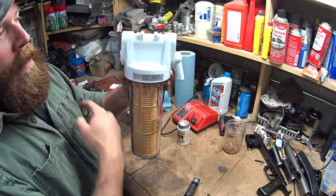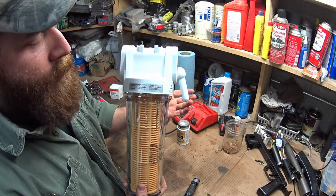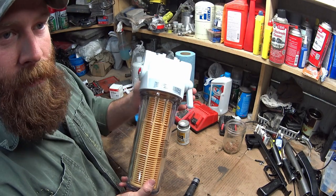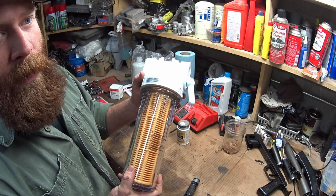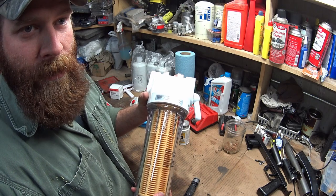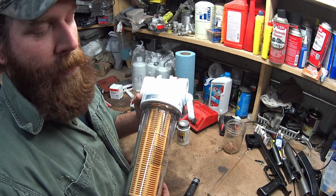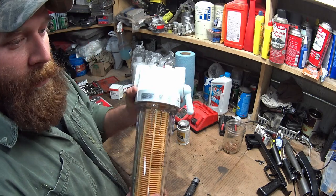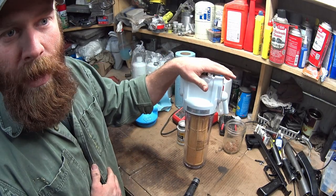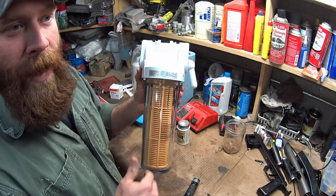Clean water goes back out the top. You can also put a pressure gauge on here to see how much your water pressure is dropping. If your water pressure drops a little bit, clean out your sediment filter. This will keep sediment from going into the harmful places like your ball valves, needle valves, shutoffs behind your toilet, tub, kitchen sink, etc. It's a $30 fix versus what they want to sell you — a hot water heater filter for like 60 or 70 bucks. Even without a filter in here it basically makes an old-fashioned catch basin.